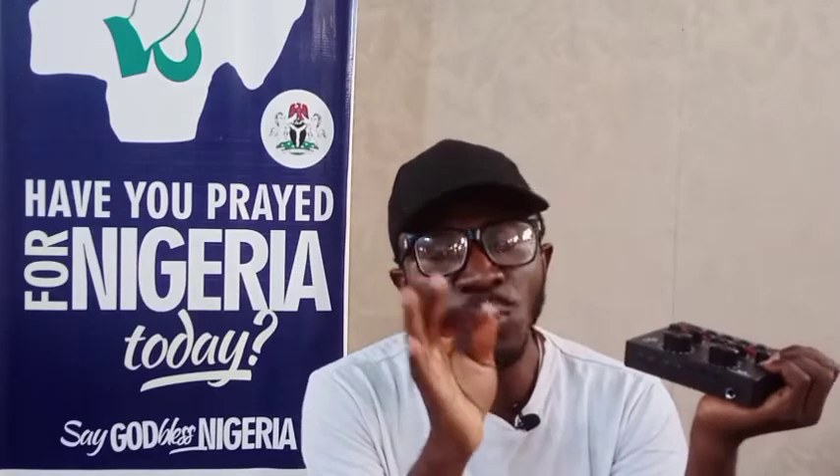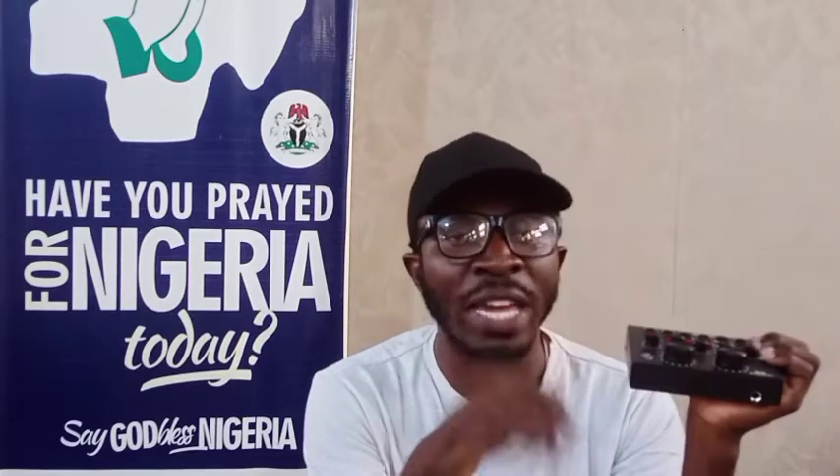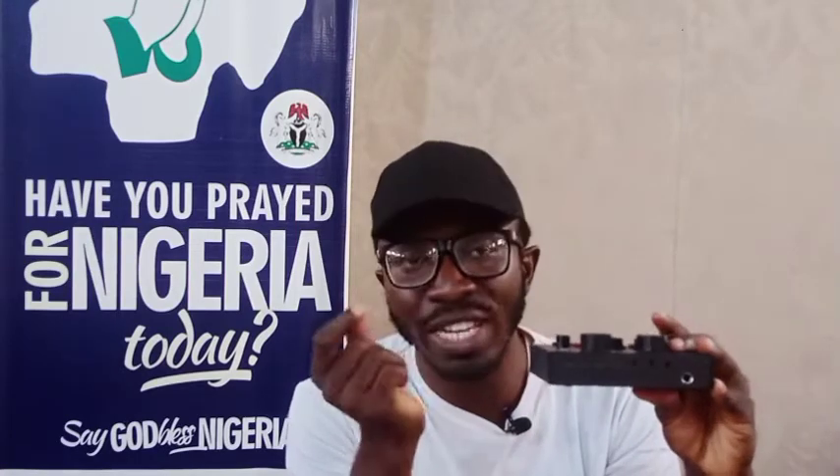If you can hear the background sound, the V8 sound card is working. The likely problem is your mic. First, confirm your mic is working. If you're using a condenser mic, make sure you're plugging it into the correct port — the wrong port means it won't work. To troubleshoot further, you can use a normal earpiece or headphone. There is a specific port on the sound card for your earphone input, so plug it in there, speak into it, and see if you can hear yourself. This helps you determine whether it's your condenser mic or lapel mic causing the issue.